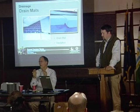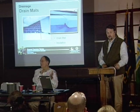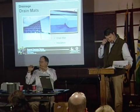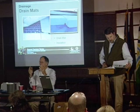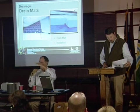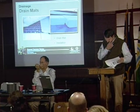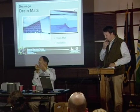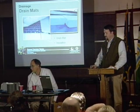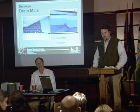They've only measured for warm temperatures. They haven't measured for cold temperatures yet, so we don't know what that's going to be. The other thing that's interesting is that they're not studying the reflective characteristics. Reflective roofing doesn't really have an R value, but it reflects that heat, so in a sense it's like it has a certain R value, but a different value. The vegetation and soil absorbing or reflecting the heat, to my knowledge, has not been studied, at least not in this country. I'll bet the Germans are looking at it, but not in English yet. Or maybe it is, and we haven't seen it.